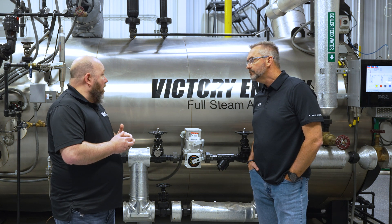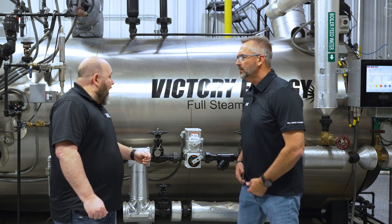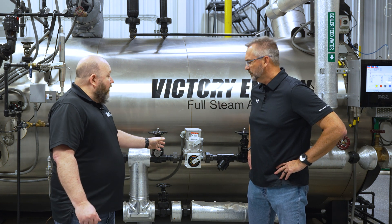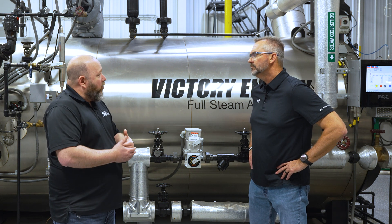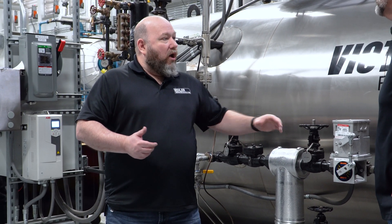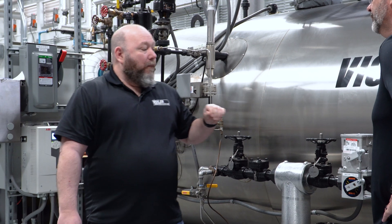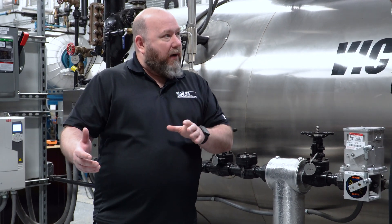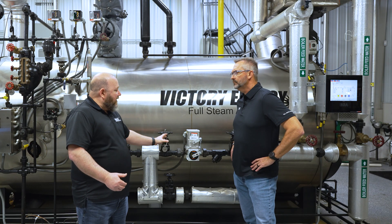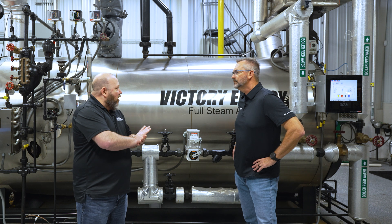Operating pressures are really below 250 PSI — we don't want to go over that 250 PSI mark. The reason is the valve's Teflon ratings; the seats in the Teflon. The valve itself is actually rated for 1,000 PSI cold working pressure on water, but the Teflon seats are about 500-degree rated. When you look at a pressure and temperature chart for water, 500 degrees is usually way higher than a deaerated temperature. But when you get into higher operating pressures, you're usually feeding boilers at way higher pressure with the pumps. The way these valves operate, they could be partially open at times, exposing the seats to a high flow, high temperature scenario.